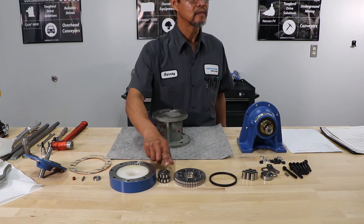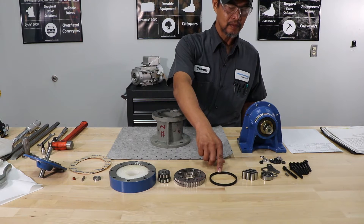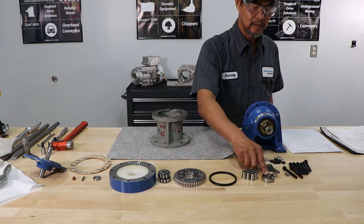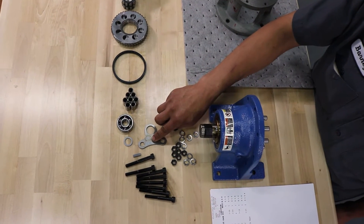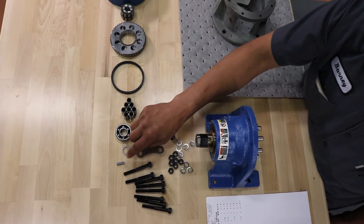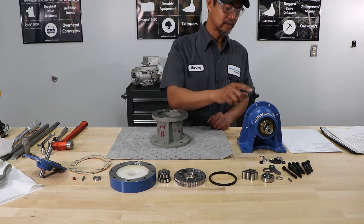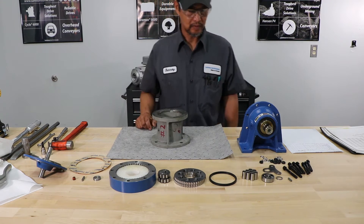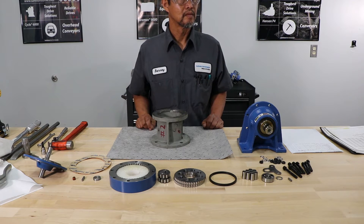You have the eccentric bearing, or some people call that an eccentric cam. You have your set of cyclo-disc. You have your cyclo-disc spacer. You have the slow-speed rollers. This is the top bearing. This is the top spacer. You have your hanger — this is the gearbox hanger. You have your hardware. You have your high-speed key, which will be installed last — that would be the customer's connection, the high-speed and the low-speed key. And last, you have your slow-speed assembly, or some people call that an output block. You can see that's already assembled — there's two bearings in there, a seal collar, and a low-speed seal. The key is already taped to the low-speed shaft.